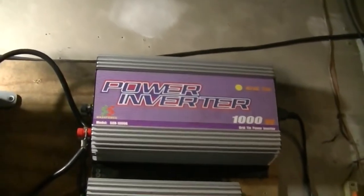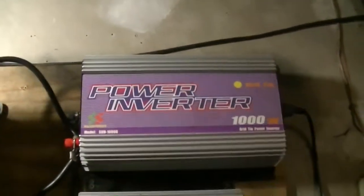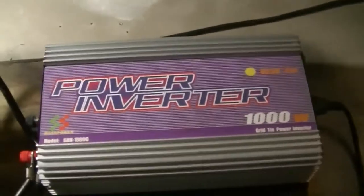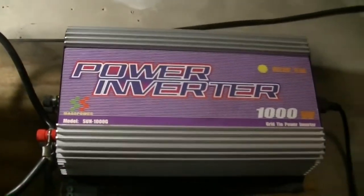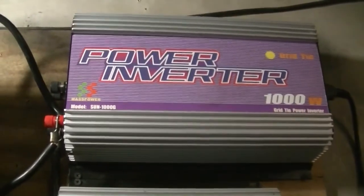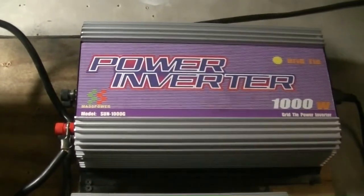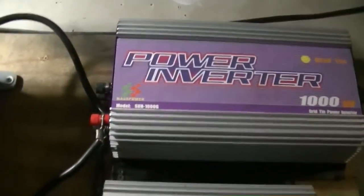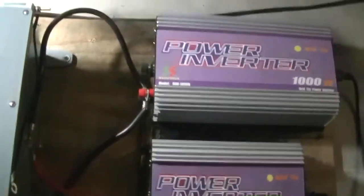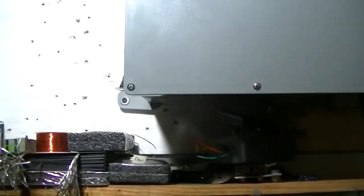I took the 22 to 60 volt 1000 watt inverter apart — it had two bad MOSFETs in it, so I changed them out. It was still working but was going directly to dump, so I had to disconnect the dump load and that seems to be working pretty good now. I do have it hooked up to the system here, with the wires just temporarily hooked up. I made a significant change — let me move my tripod.